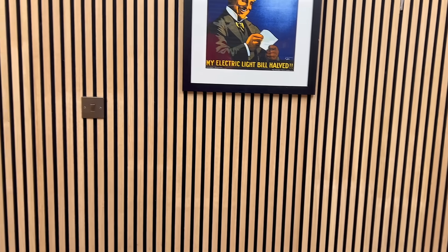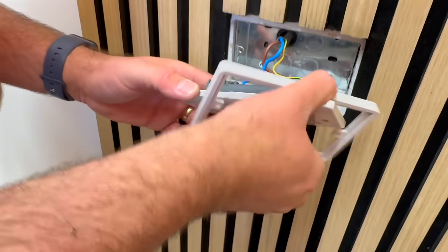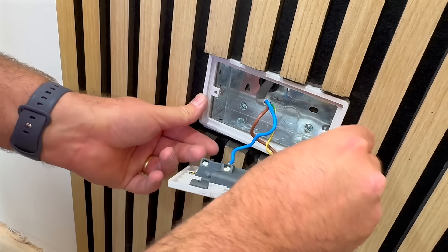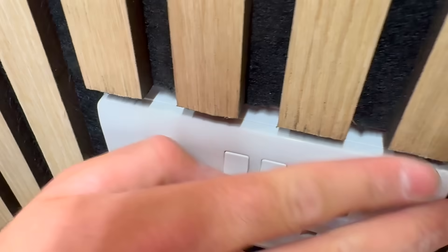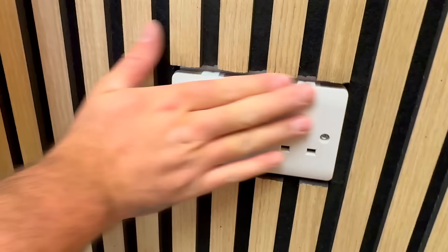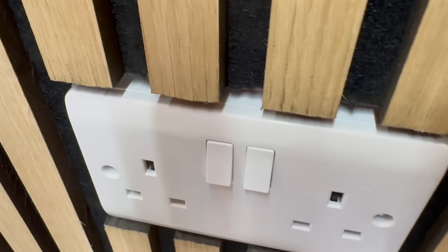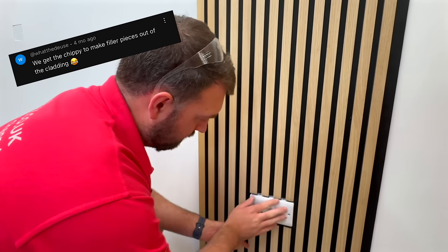The easiest way to bring the socket flush with the slat wall and make sure no one can touch live terminals is to use a plastic socket box spacer. That's exactly what I did in my original installation, thinking I was offering a solid safety tip to the industry, and to be fair, from a safety standpoint it works. The accessory sits proud of the slats, the terminals are protected, and it helps meet the IP 4x / IP 2x requirements. But there's a downside: to use this method the cutout in the slat wall has to match the outside dimensions of the socket faceplate, not just the metal box behind it. That means the edge of your cut is visible around the accessory, and unless you're particularly skilled in joinery, that opens the floodgates to criticism.